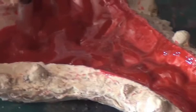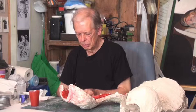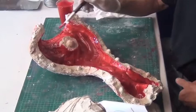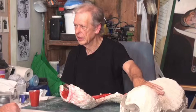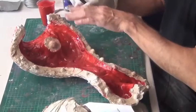You wouldn't continue to just sort of keep working that? You just have to wait now until it just hardens? Yeah, you've got to let it harden and then give it another layer, maybe another two layers. And then on top of that, you put in fiberglass tissue. Okay. And from there, you do the other side as well? I do the other side as well. And then I put the two together, which looks like this. And then I fill the end. I put the clay around here to make it sort of waterproof. And then I roll, I put an amount into there as I've mixed here.